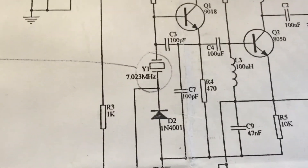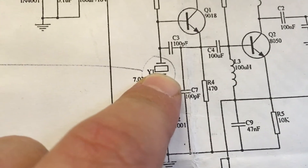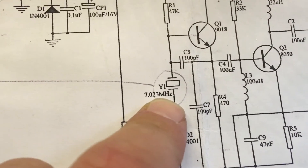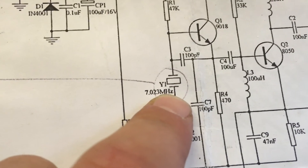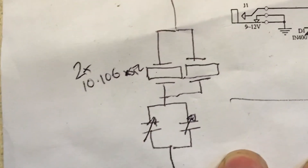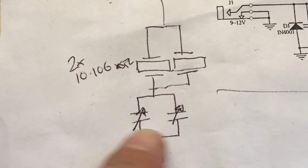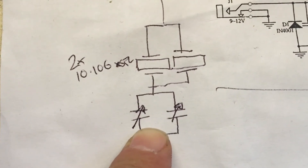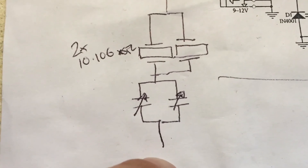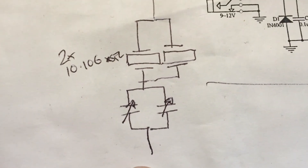The other modification I've made to these radios is to take out the 7.023 megahertz crystal. On the 40 meters one I've added some switching and we've got 7.023 and 7.030 and also a ceramic resonator in there so we can switch between any of them. But in the particular one I'm showing you at the moment, which is the 30 meter version, I've got two crystals in parallel for 10.106 megahertz and then I've also got two variable capacitors in parallel as well, just to add a little bit more capacitance to swing the frequency — which you might have seen in the video clip with me adjusting both of the pots at the same time. Really useful just to give that little bit of extra frequency coverage.